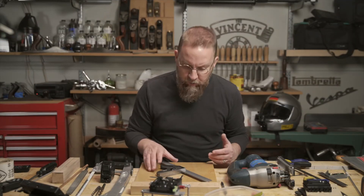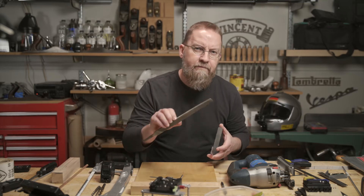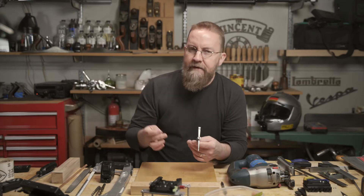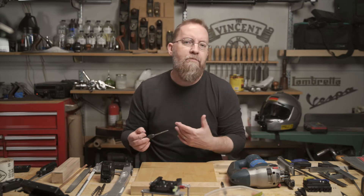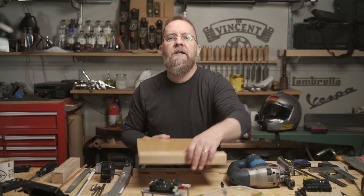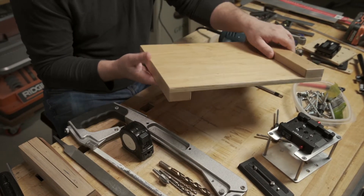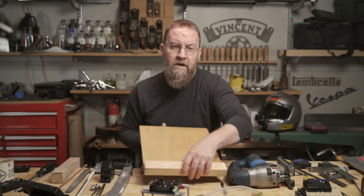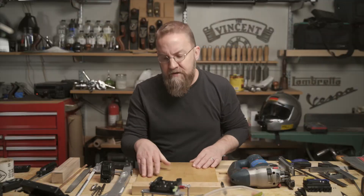For this project, you're going to need some basic tools: a way to mark and measure your cuts, something to cut metal, and something to smooth the cut marks on your edges. You'll need some drill bits, including a countersink and a 10-24 tap, and cutting oil for threading the tubes. You'll find this much easier if you use a drill press, and some kind of stationary sander will be hugely helpful, but you could do it with a handheld drill. I'll show you my method for cleaning up saw marks by hand using a simple fixture called a bench hook. It allows you to hold material and make cuts or clean up edges safely and securely. Mine is a half-inch piece of plywood with two cleats glued and tacked into place. The lower cleat goes up against the edge of your bench, and the upper cleat supports the material. The cleats are 90 degrees to the platform edge, which means you can use that edge as a guide to square and clean up your edges after you make your cuts.